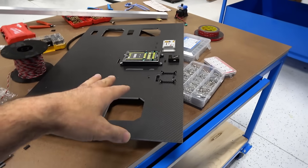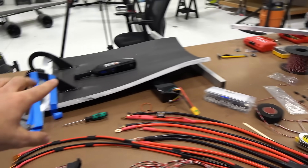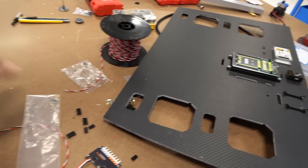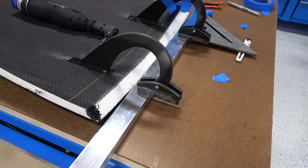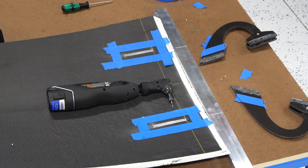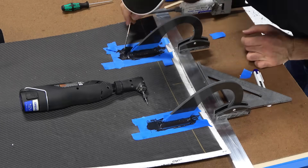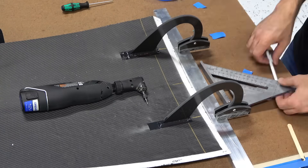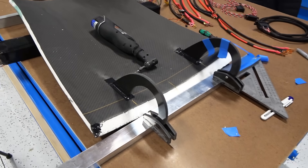Now I'm ready to install the board, but before that I needed to finish the hatch, because there will be some cuts on top of this board. I'll install this and finish it, then proceed with the board itself. This part is going to be glued and the other part is going to be removable. These are the hinges — they are actually big — and this is 6mm carbon. I need it to be big so this hatch will open around 120 degrees, which is great. We're still looking for some kind of latch so we can click it closed and use a button to open it. I'll wait for this to cure and then glue it in the fuselage, and hopefully we will have a functional hatch.